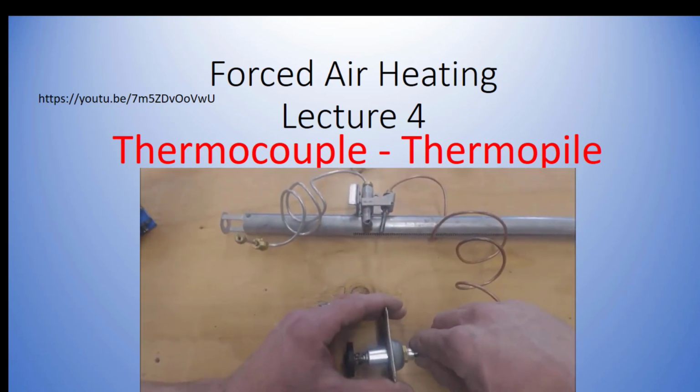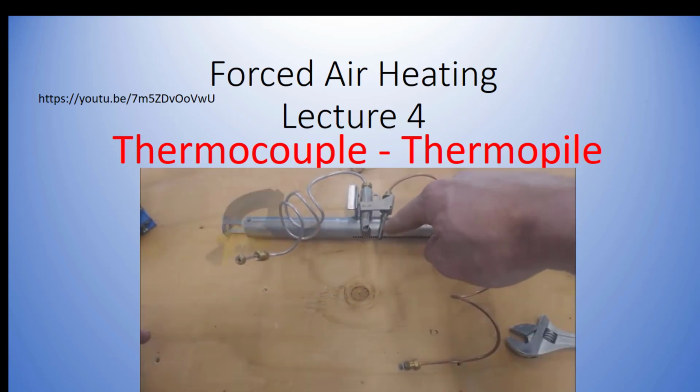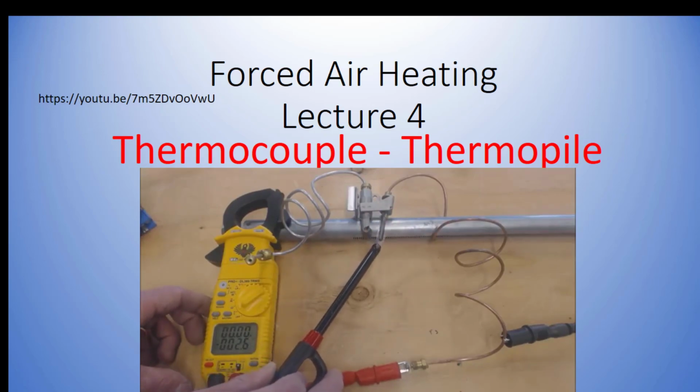Now let's go ahead and check how many millivolts we have anytime that we're heating this up. All right, so you see we have our multimeter set on AC. We want to go ahead and change that to DC voltage, which is the straight line. So we're going to go ahead and heat this up. As we heat this up, you see the millivolts is increasing right there. Okay, this is a 30 millivolt thermocouple.